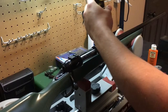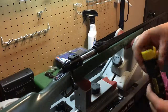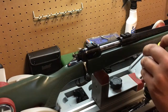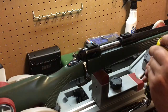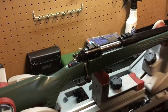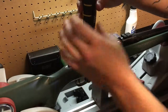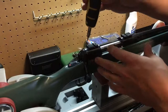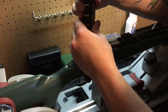It's extremely useful. So now that we have these both started here, I'm going to go ahead and torque these down. I'm actually going to only do 15 inch-pounds on the base as I'm scared of stripping it. So I've actually decided I'm going to go to 17 inch-pounds as I'm a little bit worried about stripping. I forget the exact torque specs for these, which a lot of times you can find online, but sometimes it's hard. But a lot of manufacturers have different torque specs for each one. So I'm just going to go ahead and slowly bring this up.